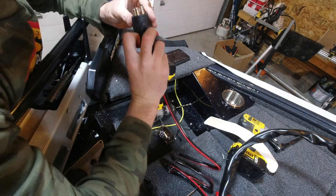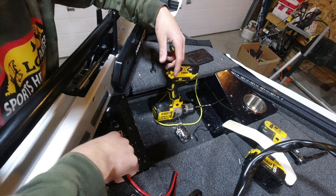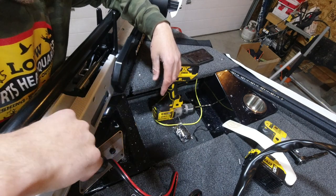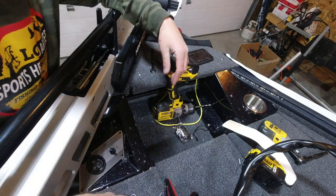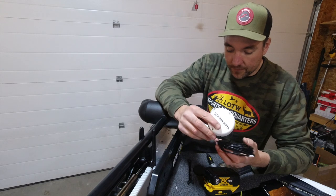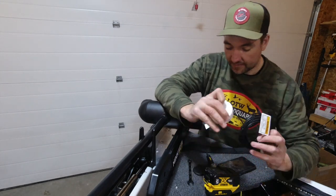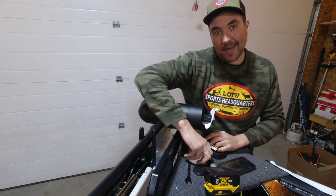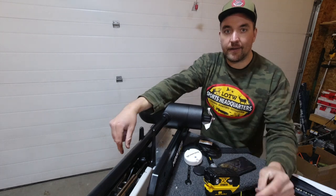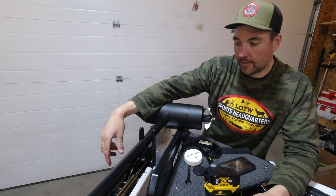Push it back up — there are usually little tabs here you line up. This thing is good to go — plug that in, and that's it for wiring. This boat is factory rigged already for a 36-volt system. Depending on your system, that's a whole other ball game, but this one's nice and handy and already ready to go. A lot of these trolling motors also come with heading sensors that need to be wired to 12 volt — I'm still working on my setup for that, so I'm not going to wire this in right now. I usually just center it and run the wire into 12 volts. The prop is in the box, so just slap that on and you'll be golden.